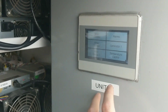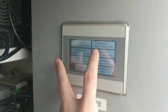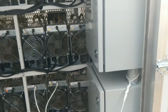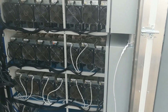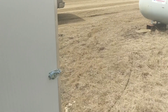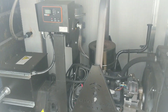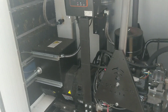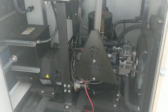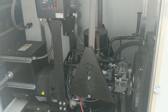We also do control systems. We have a PLC controller — these are very, very nice. Basically this regulates the fuel gas consumption, so that if the fuel gas availability drops, it'll drop the load on the engine because it's watching the engine RPM, and it'll actually drop the load in response to the fuel gas availability. If you want to deploy it to a well site and consume all the excess gas, even if it's fluctuating, you can use these units in parallel and it will throttle up and down based on the fuel gas availability.